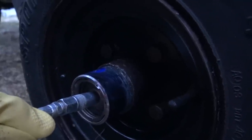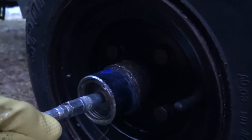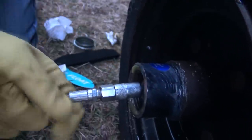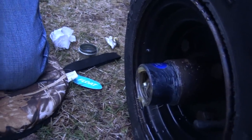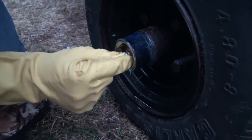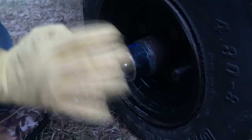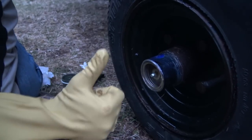That spring pressure is going to keep water out of here for a very long time. Anytime I need to top it up, I don't have to pull it off — I just put this grease gun on there. It's a huge time saver. Look at that — it's starting to bleed around the edges, which is what we want to see. That means the whole cavity is full, the bearing is full, it's under pressure and water cannot get in. I'll just clean that up with a paper towel and there's a little bra that goes on top to keep dust and junk out.